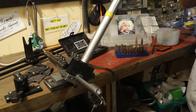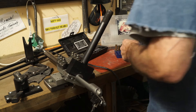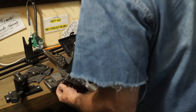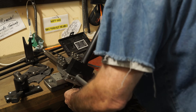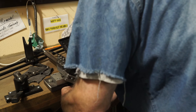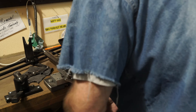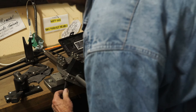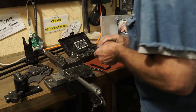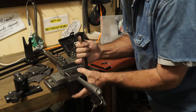There we are — that is exactly 150 foot-pounds on this guy. Now what I can do is check some headspace and find out. I know what we wrote down before. This is just one of those little experiments I've never actually done before, even though I've talked about it many times — like, how cool would it be to find out how much it changes from hand tight to 150 foot-pounds? Because I throw these things together — I just put them tight with my hand on the barrel and my hand on the action.